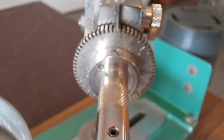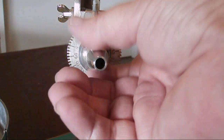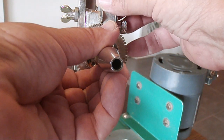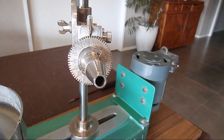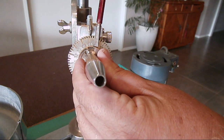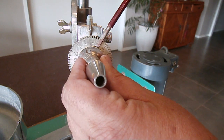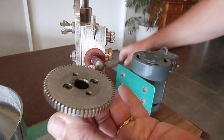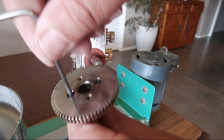Let's have a look at the quill assembly and particularly the index wheel. All faceting machines have an index wheel of some type, which is usually attached to a quill, and that quill rotates on the shaft within the faceting head. Occasionally you will need to replace the index wheel. All index wheels have various amounts of slots or teeth cut into them, but not every index wheel will suit a particular gem design. So sometimes you will need to detach the index wheel from your quill. On some machines the entire quill and index wheel are one piece and you cannot detach the wheel.